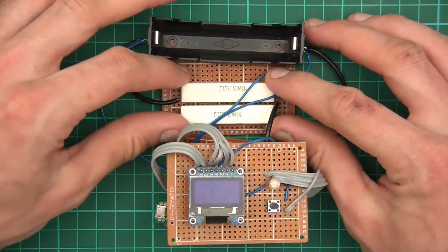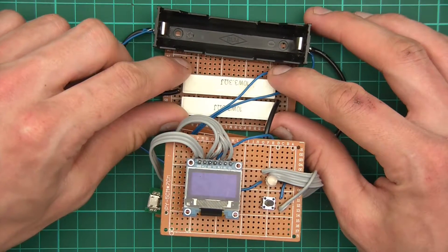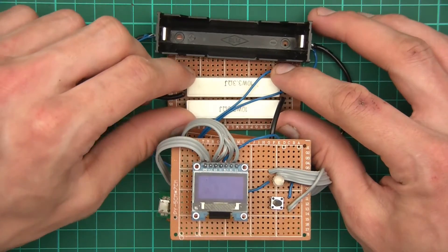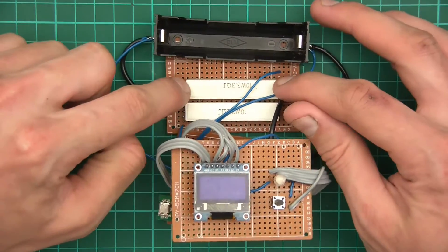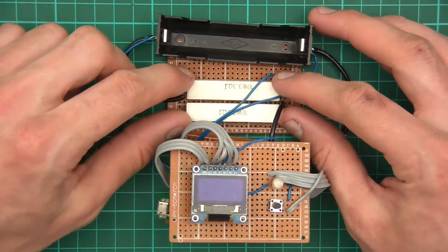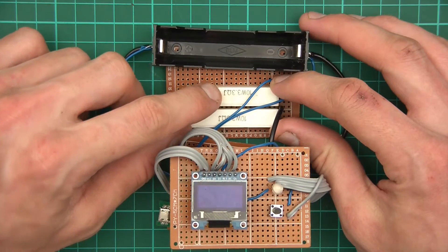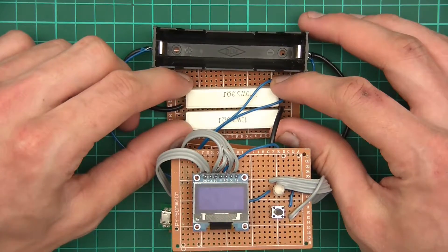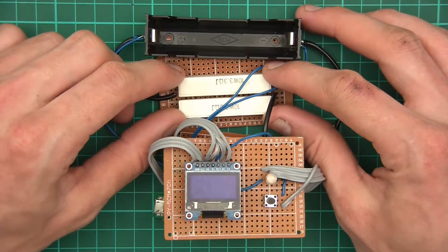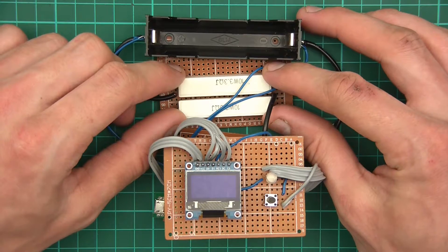The drain loop goes from the load to the resistors. I've changed that — it used to be one aluminum-clad resistor, a 100-watt 1-ohm unit. This is more appropriate now because I've changed the wiring and the resistances have all changed. I've changed this to two 3.3-ohm resistors in parallel.